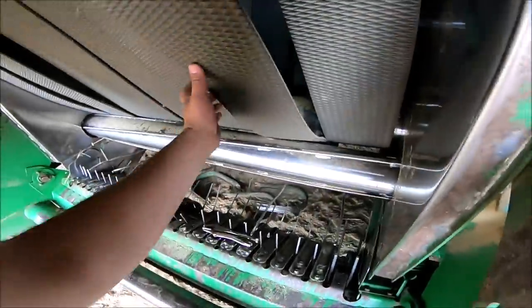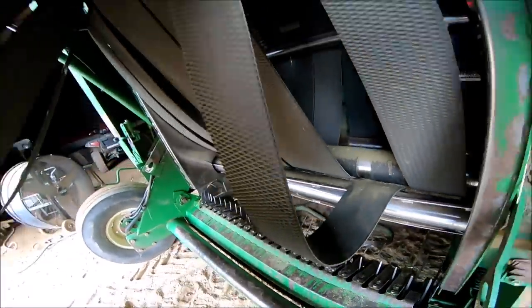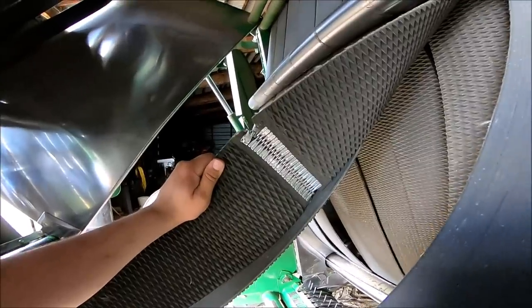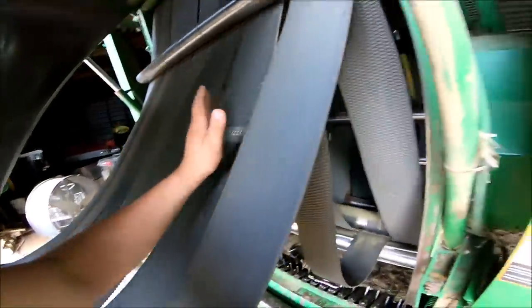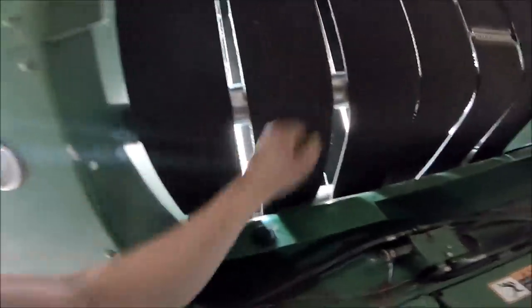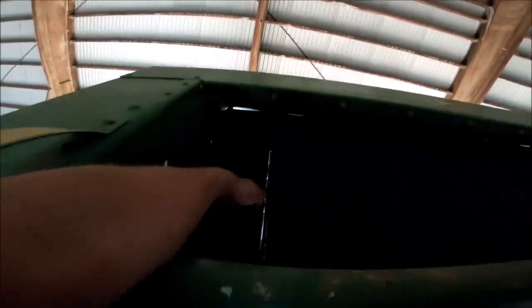This is just common sense - the belt's starting to tear like that, replace it, take it out, get it fixed. The splice is right here. One of two things is going to happen - either I'll take it out if I can pull that bar out, put a new belt in, get this one fixed, and this one will be my spare with a splice in it. It's a short belt. The long belts are over here - it's got four of each.